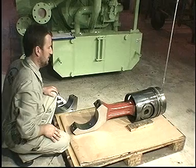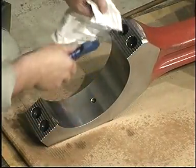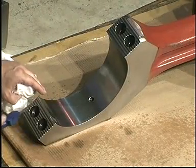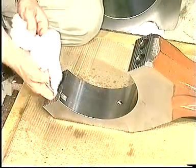Clean all machined surfaces of the connecting rod and bearing cap. Clean the serrated joint faces and threaded holes with a volatile solvent and then blow-dry with compressed air. Check the serrated joint faces for wear marks, pitting, cracks, etc.